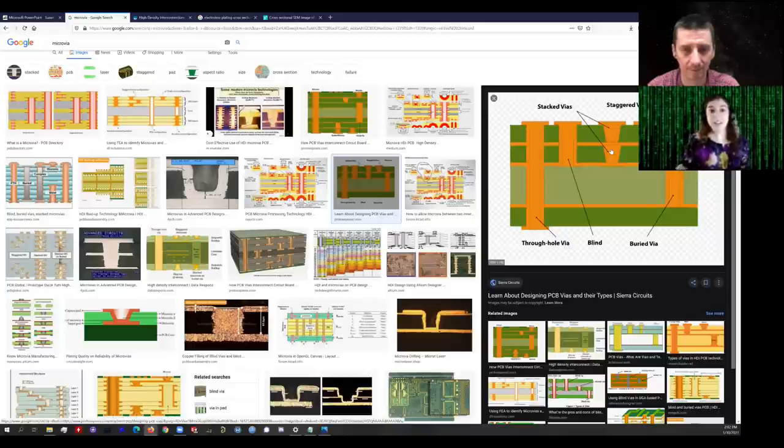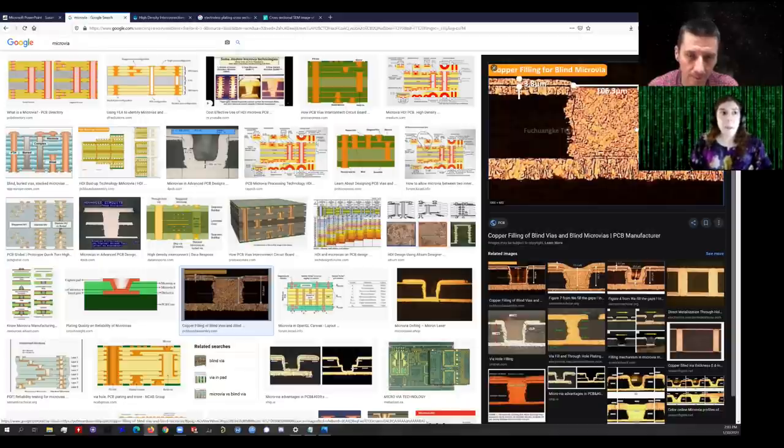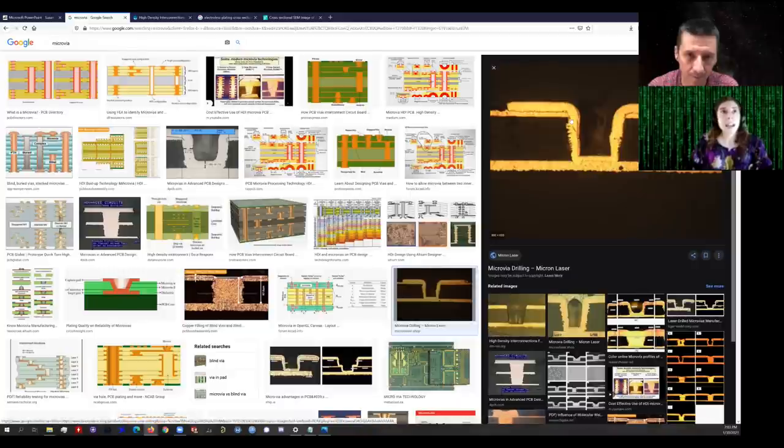You never want to have holes in the board, especially if the board will experience pressure or vacuum, because you'd have pockets buried inside the board subject to pressure changes — you never want voids. They can fill with epoxy, and if they do, they'll planarize the entire surface with a polishing process. Then they can electroless copper on top of the epoxy and electroplate again on top, allowing you to make what's called via-in-pad — a perfectly planar surface where the via barrel sits right underneath the pad. This requires fill, planarize, electroless, and electroplate steps — a lot of steps — making it a lot more expensive. Alternatively, using leveler and brightener chemicals, if the via is very shallow, the plating solution can actually fill the via up entirely with copper, giving a cross section that's fully filled. More likely though you'll see vias where copper is connected but with an interface that can be liable to crack, so there's very tight process control to make sure you never get a fracture of a microvia.